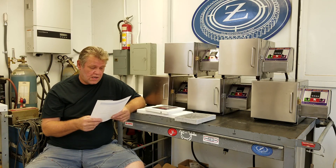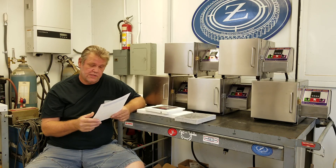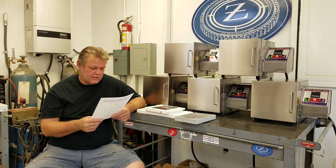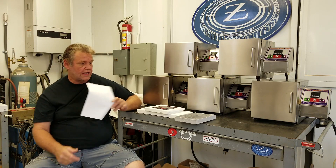For performance: it requires a 120 volt, 20 amp supply. It's got a 2,000 watt heating element with about 17.8 full load amps on the entire oven. Maximum operating temperature is 2,000 degrees Fahrenheit. From a cold empty oven it'll do ambient to 1,200°F in 20 minutes, to 1,500°F in 30 minutes, to 1,700°F in 40 minutes, and to 2,000°F in 50 minutes. They're fully assembled and bench tested before shipment.